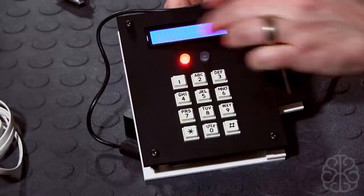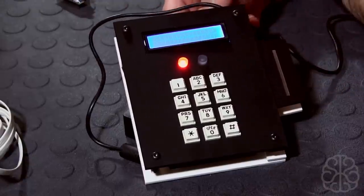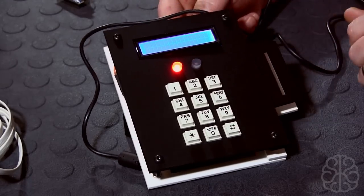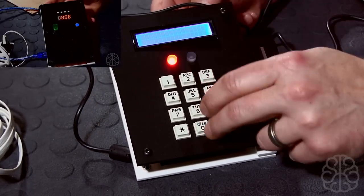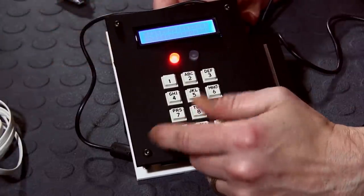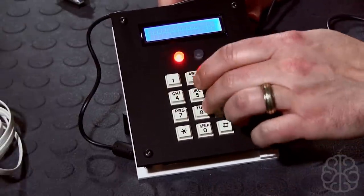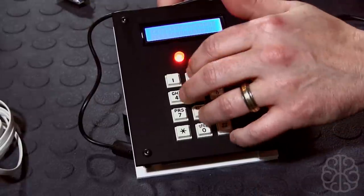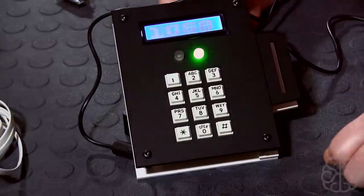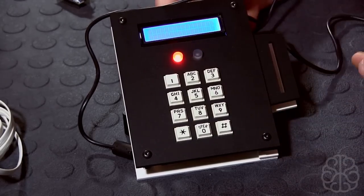At the beginning when I designed it, when locked it showed 'lock' on the LCD screen and when opened it said 'open.' But the client came back and said he didn't want anything displayed when locked — just enter the code and it flashes the code. So the code is 1-0-6-8, and he didn't want it to appear beforehand. If you enter the asterisk it's like entering a bad code and it rejects it. If you make a mistake you can enter anything since those extra keys aren't programmed. When you press the correct key to open the door, the green LED flashes, it shows the code, then goes back to locked.